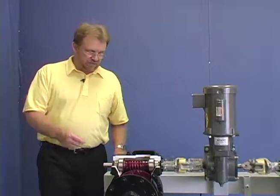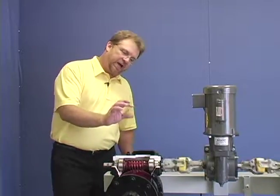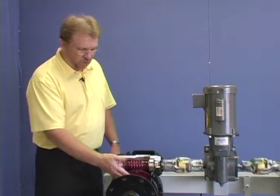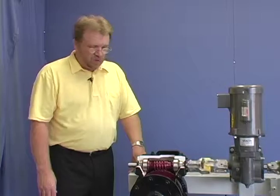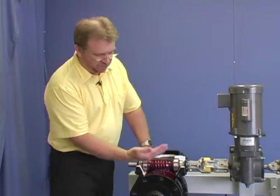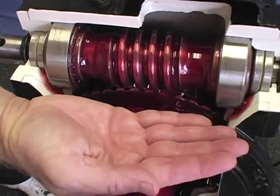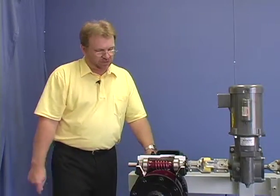The adhesive cohesive package that Sprinkler Lube has helps it, if the oil level is too low, to come up here and cling to these parts. When you shut your system off at the end of the season, if your seals are bad, or even if your output seal is bad, the lubricant level is going to drop to at least here, or maybe even lower, to where we have it in this box for illustration purposes.